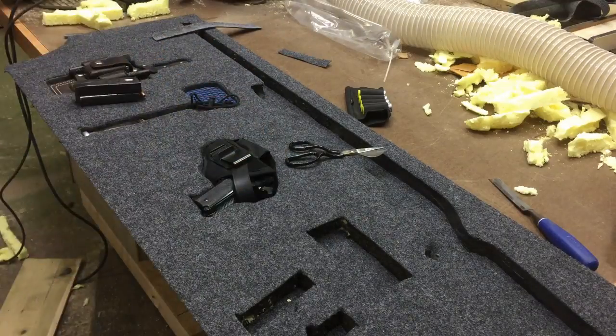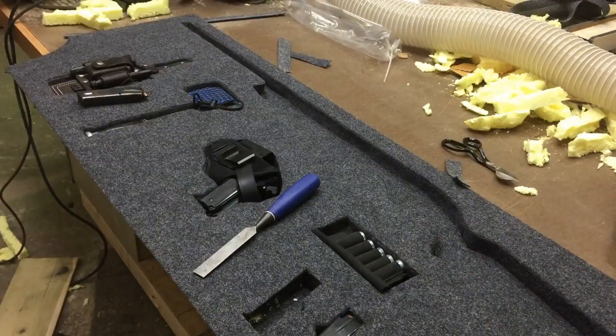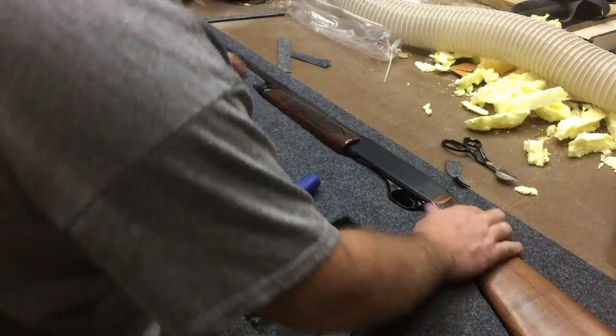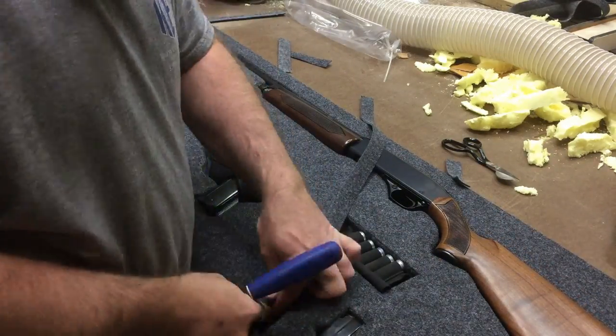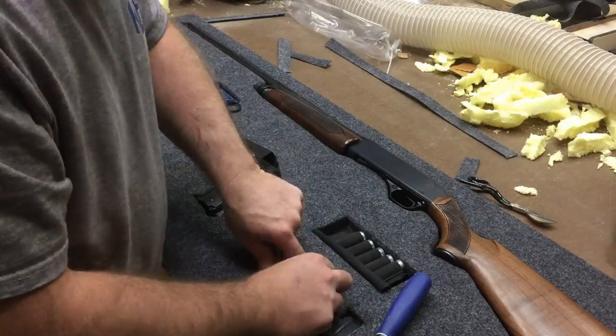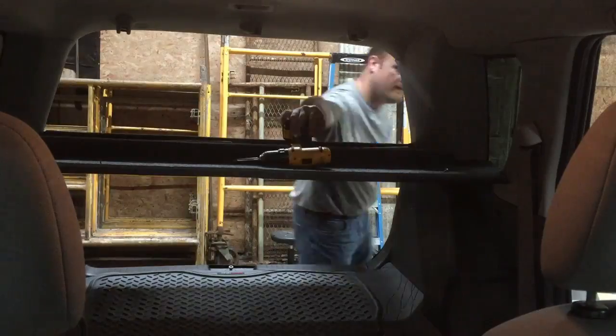For the most part, I paid attention to the outside corner. I wanted those to come together tight. If they weren't perfectly tight on the inside corner, the black paint would hide any gaps there, but the outside corner is always visible even when the pieces are physically in their spot.